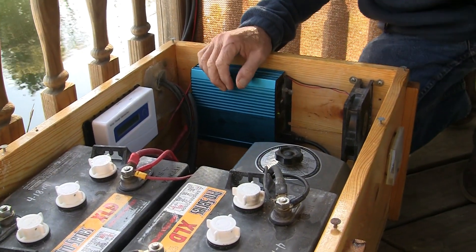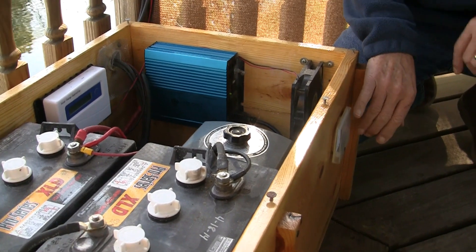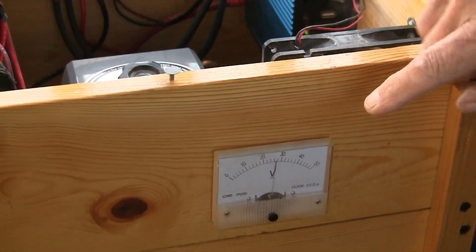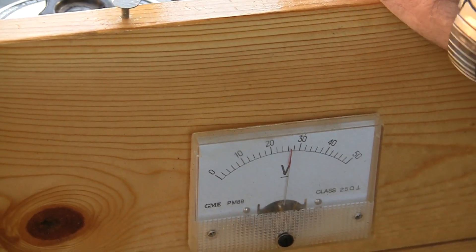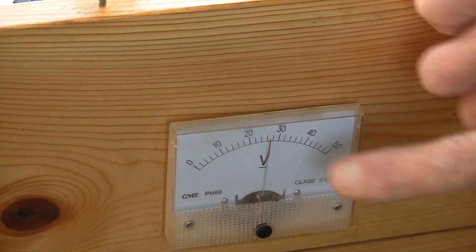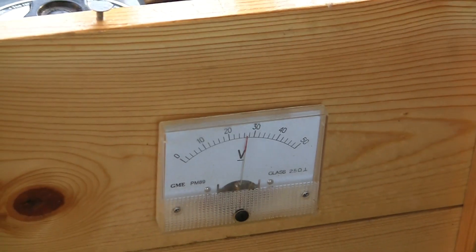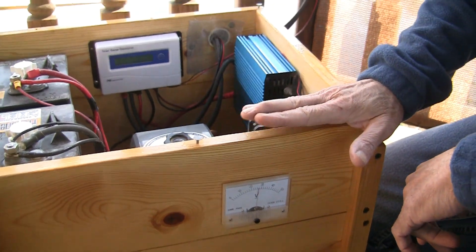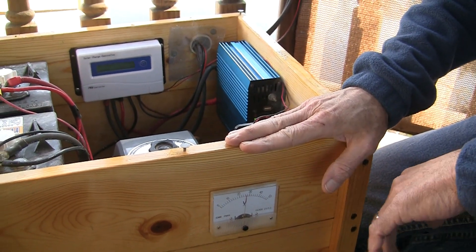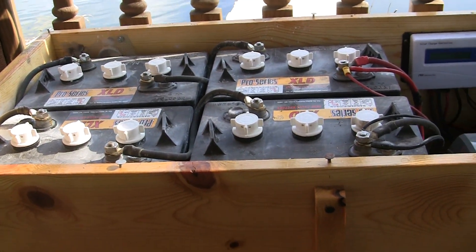This has been working flawlessly for a long time. As you can see on the front, I installed my voltmeter, and it's five after five in the afternoon. Look at how far out my battery bank is — twenty-six volts. This is a twenty-four-volt bank, and this is five-thirty in the afternoon. This never, ever shuts down — it runs twenty-four hours a day, seven days a week. And I'll show you what I've got going out there.